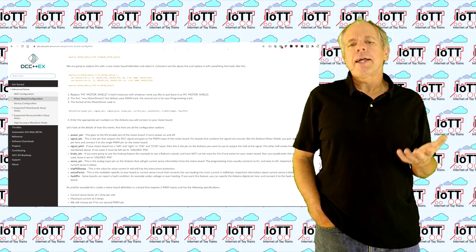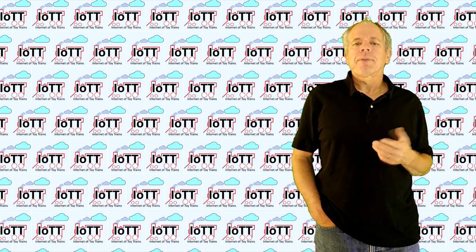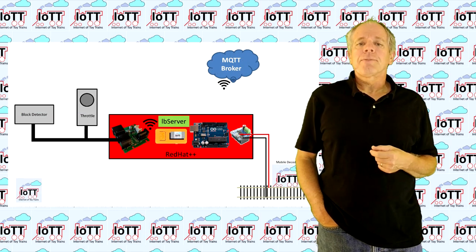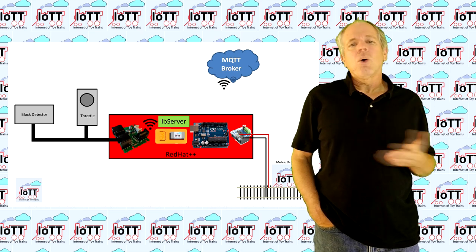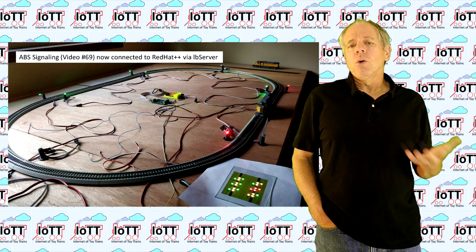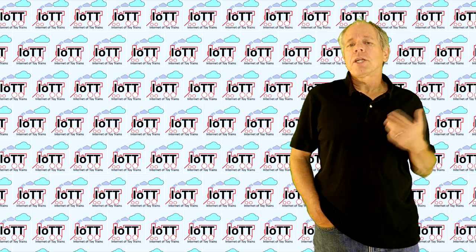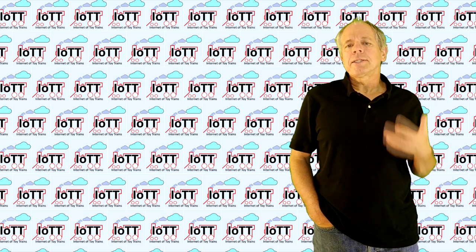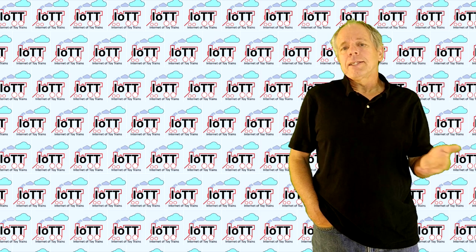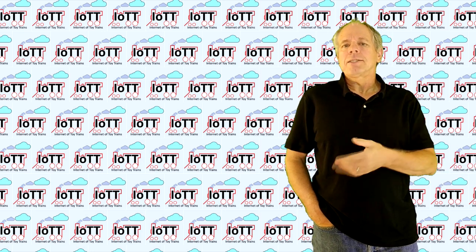For the moment, I only connected the main track and left the programming track unconnected. And with that, my modular LocoNet command station is working. I can connect one or several LocoNet throttles, assign a locomotive, and start running the trains. And since it is using LocoNet, I can connect all kinds of other LocoNet devices like switch decoders, feedback modules, or a computer. I still have all LocoNet options available that the stick offers, like the MQTT gateway and an LB server to connect JMRI. So by combining the stick with DCC++X, it becomes a fully functional LocoNet command station — or maybe the other way around: by connecting DCC++X with the stick, the Arduino-based signal generator can now be controlled with LocoNet devices.